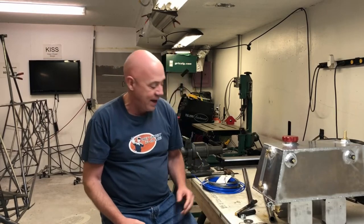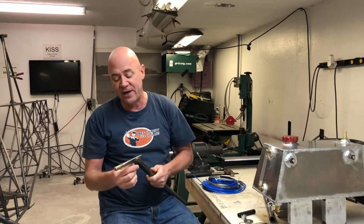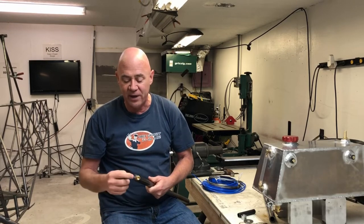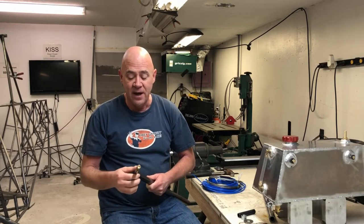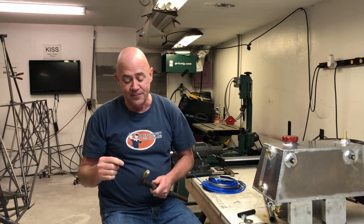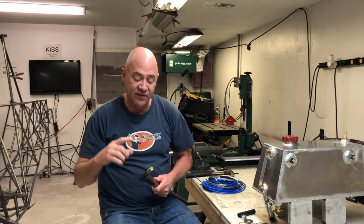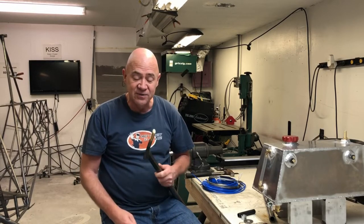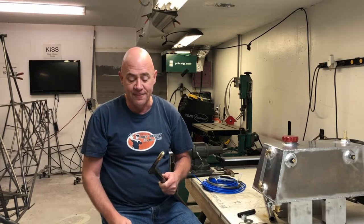Next I want to talk about my landing gear axles. I went and bought Grade 8 bolts and cut them to make my axles. I know three other air bikes built this way. Some people say you have to have a hardened axle shaft, but Grade 8 is pretty strong. The reason I went Grade 8 is they cost about $8 a piece versus $50 for hardened axles, and being the first time I welded these axles to the landing gear legs I might have screwed it up. I'm going to do some testing to see how strong these really are.